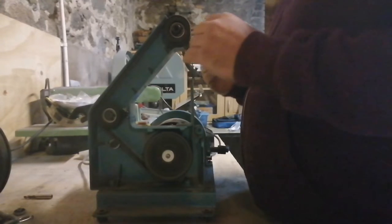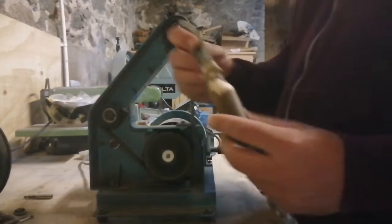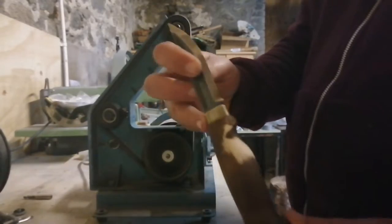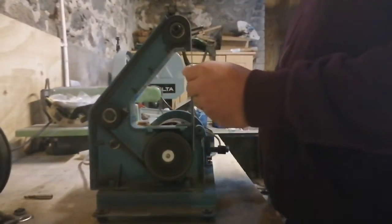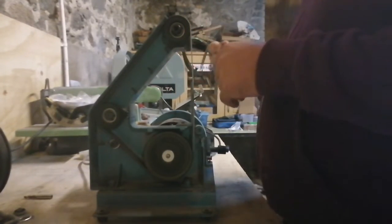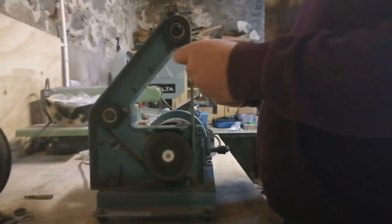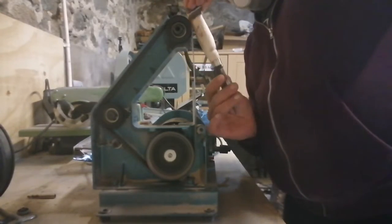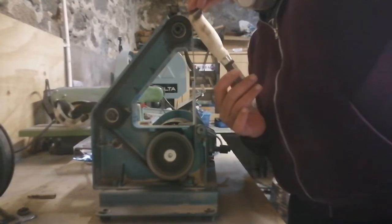So firstly, I'm going to be sanding off those edges and just kind of bringing them down to a nice smooth transition, as the contour goes for the actual knife itself. You can see here, it's not looking very neat at this point, but I'm just removing those edges. I'm doing this on my little 1x30 belt sander, taking my time, and removing the rest of the coating on the knife itself, as I'm going to be restaining it to give it a nice antique finish later.